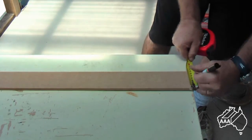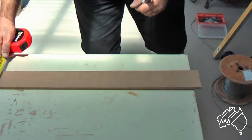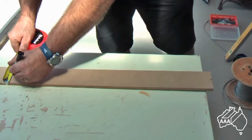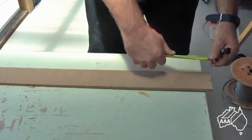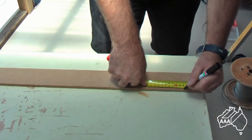If you wish you can make up a new template by marking the distances that the wires run through in your intermediate post. This distance will be exactly the same as that marked out on your saddle template post.